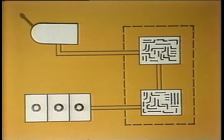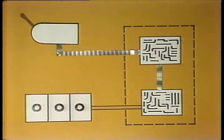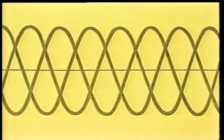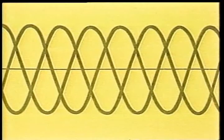In its normally off position, the driller's control sends out a 3-volt throttle signal. This produces a 7.5-volt DC control signal, which tells the firing circuit to gate each SCR late in the positive half cycle of the AC sine wave. The 3-phase AC is shown here. The shaded portion represents the output of the SCR bridge.